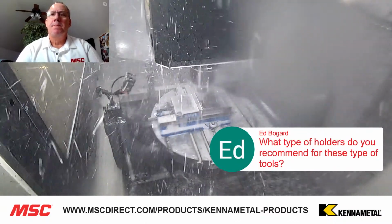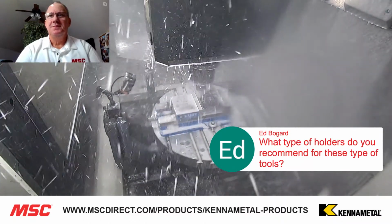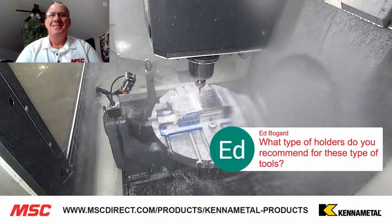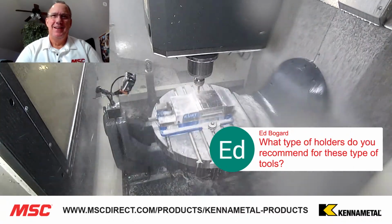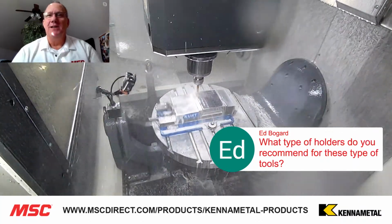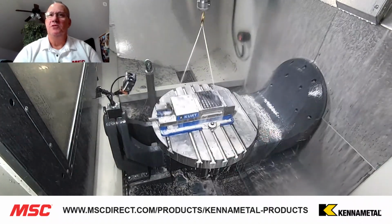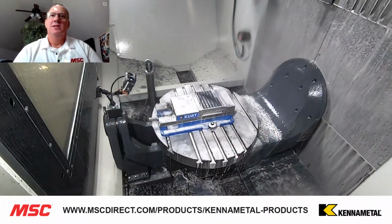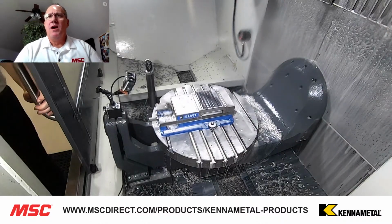There we go. We have another question. Ed, thank you so much. Hey, I like your name, buddy. His question is, what type of holders do you recommend for these type of tools? What do you have for us, Tony? Well, as a tooling guy, I'm always going to recommend the best. High-speed steels are run in Morse tapers. Sometimes we just run them in a regular type of chuck, sometimes even grind a flat on them and stick them in an end mill chuck. I prefer our Hydroforce holders.